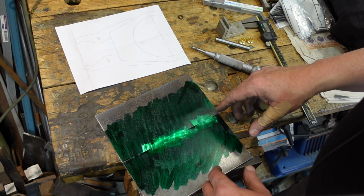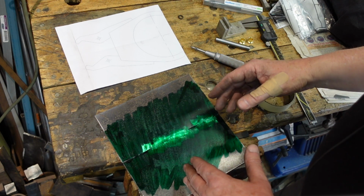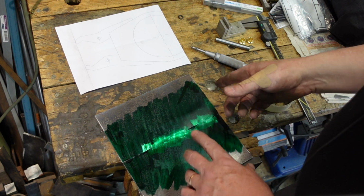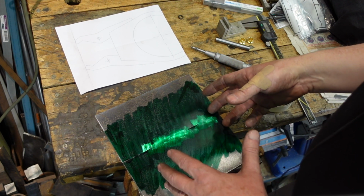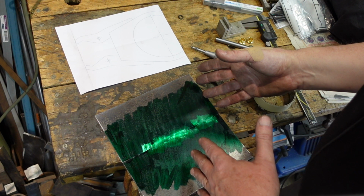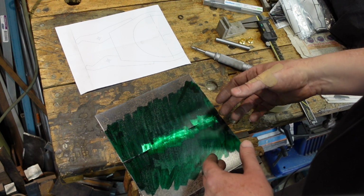But the base for the grinder is made up of a 10mm thick piece of aluminium with some side pieces added which are nominally steel. Now, aluminium is about a third of the weight of steel, a third of the density of steel, but it's also about a third of the strength. So if I took that 10mm piece of aluminium and replaced it with a 3mm bit of steel, I'd have something around about the same strength and weight.